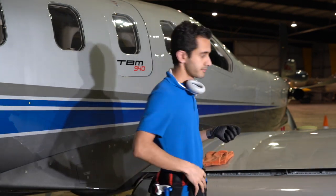That way, once we coat it, we're not locking that in. And we actually have a smoother surface too. Those scratches do increase the surface area and make it harder to clean because there's more spots for stuff to get trapped. So let's put down some tape and I'll do a test spot for you.